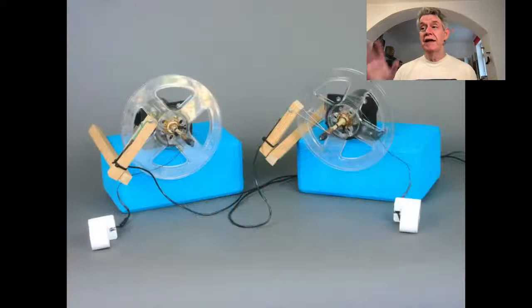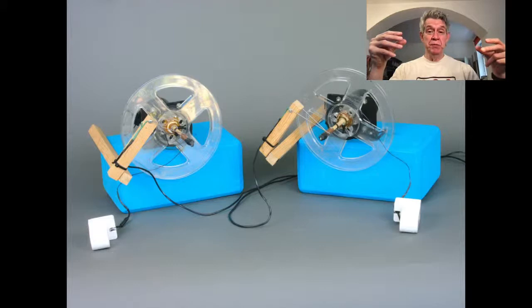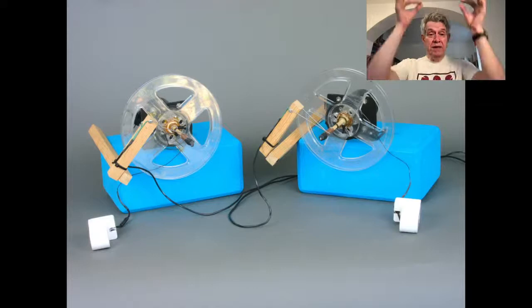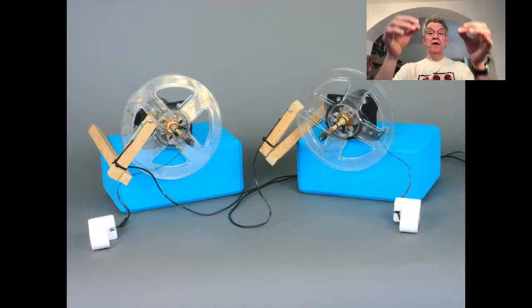So I wish I had a better picture of this up in the grid so you could see it. But what you have to imagine, these are two motors. Yes, those are 7-inch plastic, 1/4-inch tape reels that I repurposed to do this. So the motors are attached to the reels, and then on the reels is a thin piece of wire. And the two white objects you see at the bottom, those attach to a fluorescent light tube, like a 6-foot or 2-meter fluorescent light tube, yeah? So, given that this wire actually carried the power, you're going to see that in a minute, carried the power for the fluorescent light, I could make either end go up or down so I could tilt the light or go like this, or it could go straight up and down by moving the motors in coordination with each other, yeah?